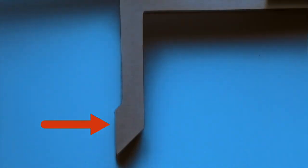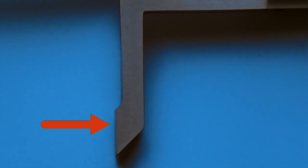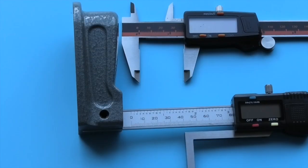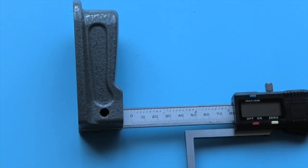This is the measuring face, and if you need to sharpen the edge for scribing lines you sharpen it on this side, not on the measuring face. Comparing the other end, the height gauge does not have the rod for measuring the depth of holes, and on the other end it has a cast iron block to stand it on.